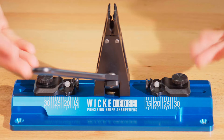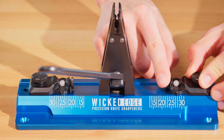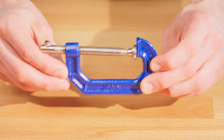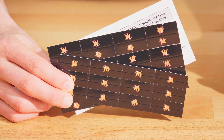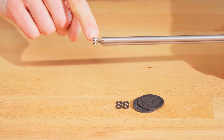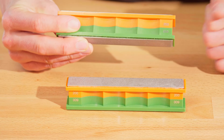Your WE64 sharpener is going to come with the sharpener itself — a blue base, a graduation plate with angle markings, two angle slides with locking thumb screws on top, and a pivot retention screw on the side that holds a very important little plastic ball, which makes sure the actual pivot points don't fall out. Also included: a dual cam vise with locking lever and removable jaws, a C-clamp to mount to any work surface, a pack of Wicked Edge paperboard shims to protect your knives or help clamp unusual blade shapes, indexing tools such as the depth key and alignment guide, two guide rods with rubber guide rod shields and o-rings that prevent sharpener debris from getting into your guide rod pivot, a practice knife to break in your diamond stones with, and two sets of diamond abrasive handles with a 200 grit and a 600 grit diamond stone installed on each.